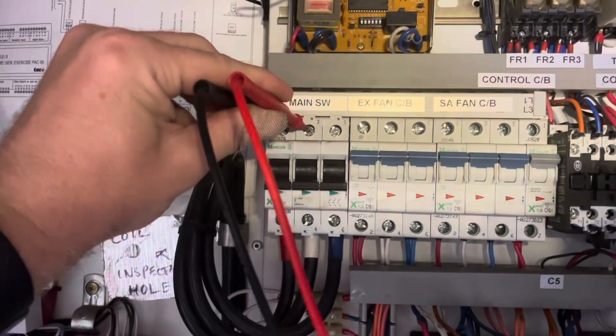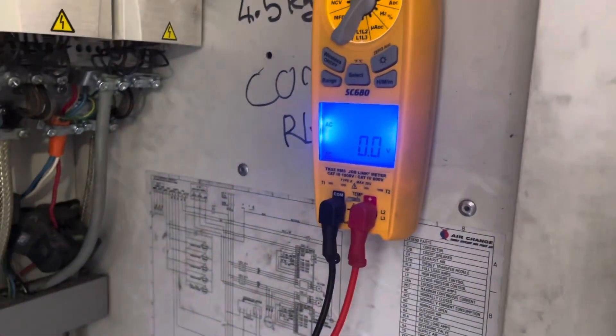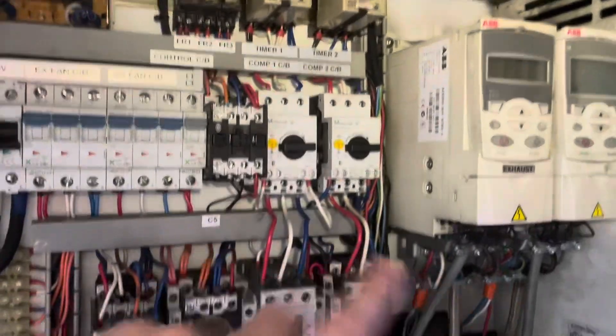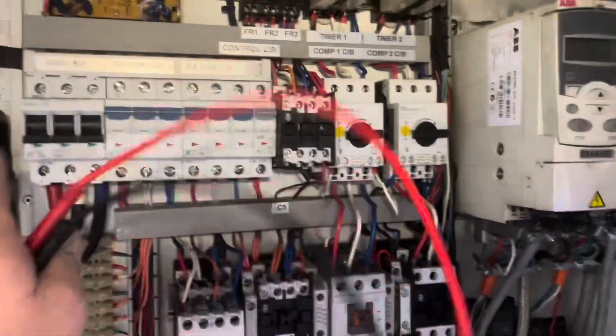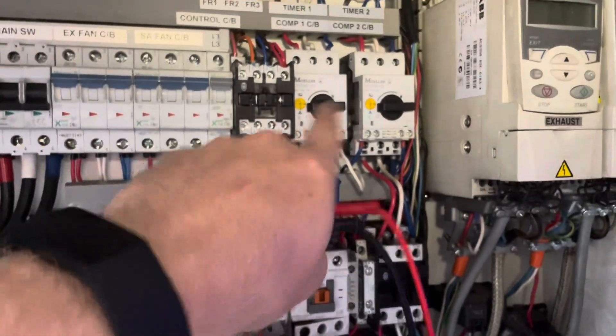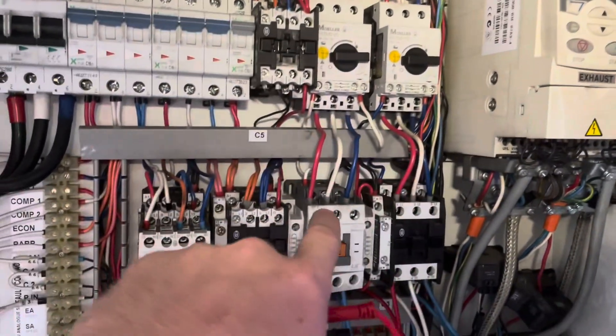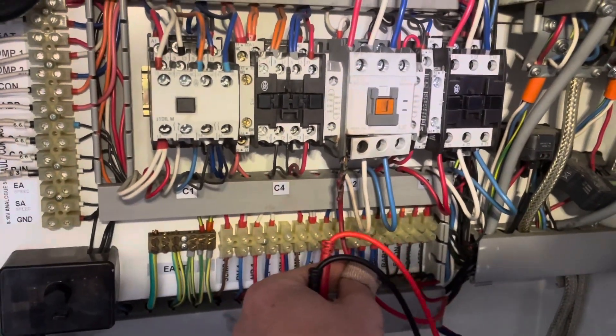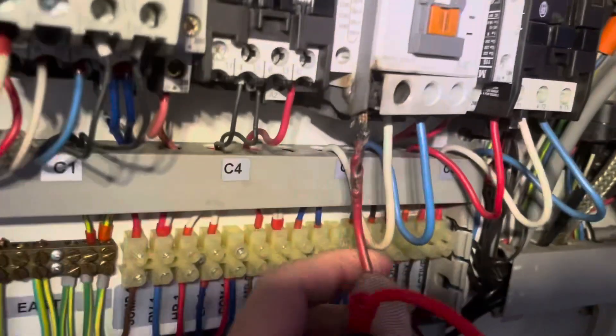So we've isolated our unit, but just going to test to make sure. L1 and L2 dead, L1 and L3 dead, L2 and L3 dead. Basically I'm now going to go in and test this isolator. The way this works — it just has a power feed that comes straight into our overload up here, which then feeds our contactor, and then — hello, there we go. That could have something to do with our trip. Very interesting — I missed that on the first inspection. We're still going to test the windings of our compressor, but look at that — that has gone bang.